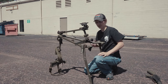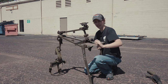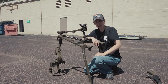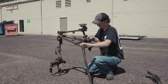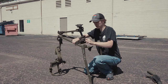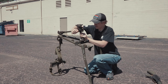When the tripod is set up into place, you also want to make sure you push these buttons in and lock the levers into position. The levers can break off if you're not careful. So that's just one thing to be note of. You want to make sure they're in the stow position. When you want to return the gun mount into transport mode, first thing you're going to want to do is make sure the throw levers are moved all the way out into their farthest most positions. This back mount, you want to make sure we move over to the left hand side and lock down this throw lever into place. We'll then remove this locking pin.